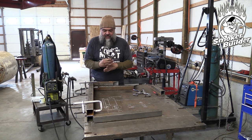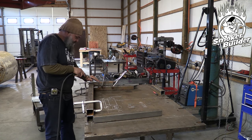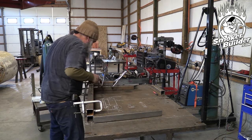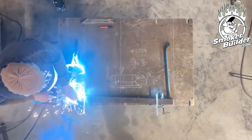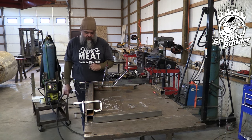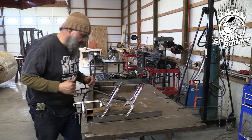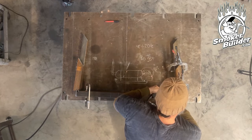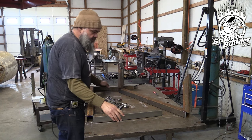These are adjustable clamps, just a little C-clamp. Same notion here — we're just going to line up the edges and pinch things close. We're going to put a tack on there. Personal safety equipment engaged. I'm going to put three tacks because two will hinge and still move around, so I'm going to put a third one. These are small tacks to hold it in place until I can get this tacked onto the main rail, and then we'll put a heavier tack on there. Looks good, it's flat, feels flush, ready to go. According to plan, this should all stay in one piece and be our last third leg.